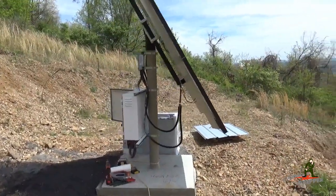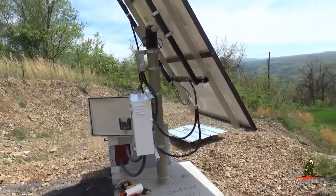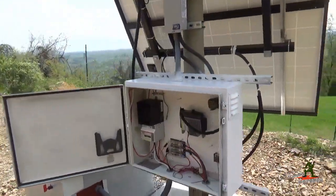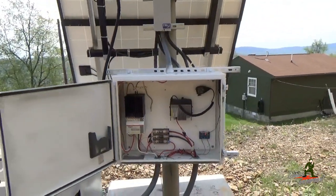I'm going to call and see if I can get an appointment with the electrical inspector sometime this week. We made the final connections this morning. I connected the ground rod to the ground bus bar in the Hoffman box, topped off the batteries with fresh distilled water, and ran a two-hour equalization cycle.